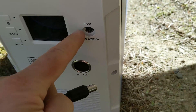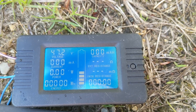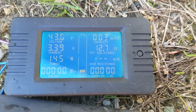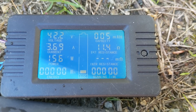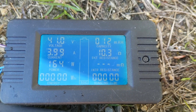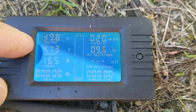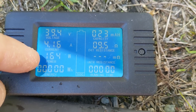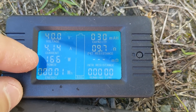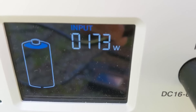So let's go ahead and plug it in. I'll keep the camera on the meter so we can watch what happens to those volts. I just heard the fan kick on for the Bluetti. As you can see it's dropping the volts down — it's looking for that maximum power point. So as it drops the volts the amps are increasing, and when the computer sees it go the other way and total watts go down, then it knows it's found its point.